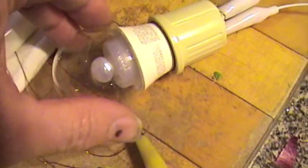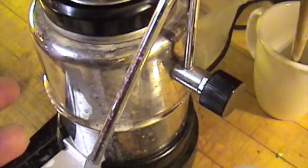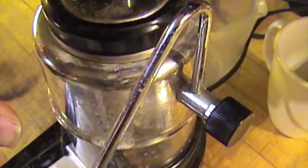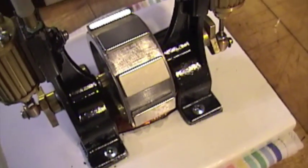So what we're going to do today is see if we can light this. This is a 3-watt, 110-volt LED bulb. I'm going to see if we can light this bulb just using this engine and this little alternator down here. Now this is kind of silly because we're using 500 watts of electricity to try and make 3 watts of power here. That doesn't make a lot of sense. Now, we're not always putting 500 watts in here because this will come up to temperature and pressure and it'll shut off. But what you would do is use waste heat, solar, or biomass to create electricity - so that does make sense.